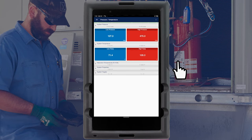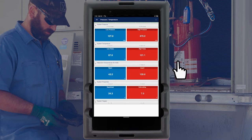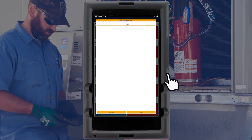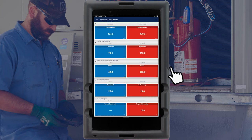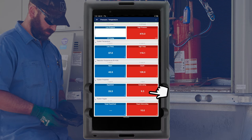The Y-Jack View app displays the low side and high side pressures, temperatures, saturation temperatures, superheat, and subcooling. It also allows for target superheat and subcooling to be entered. All these readings can be minimized or maximized to customize the displayed data. By default, the readings are displayed in numeric format, but pressure gauge and graphical displays of both pressure and temperature are also available.